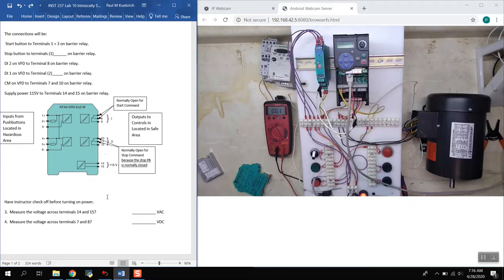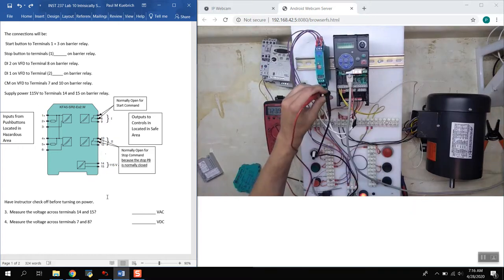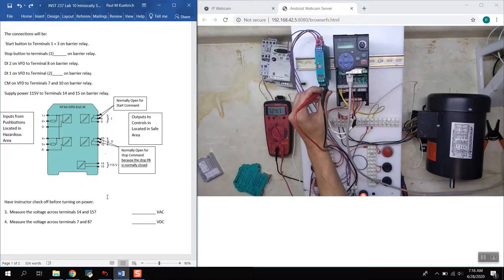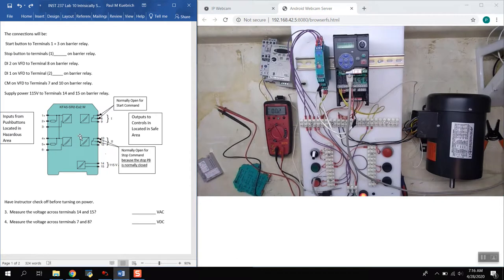These relays come in different configurations, but this one is a 100/110/115-volt relay. Make sure you get it wired up correctly. We're seeing 124 volts going into this relay here in my basement — so the voltage across this is 124 volts AC. What this relay does is convert that into a low-current DC signal that is intrinsically safe, preventing any explosion from arcs or sparks in a hazardous location.